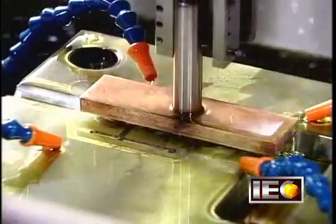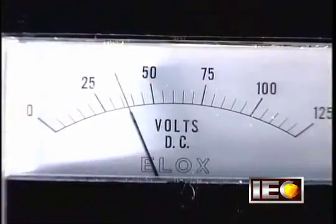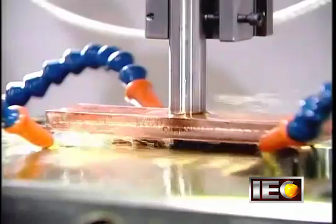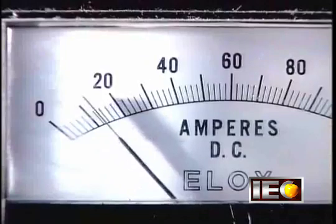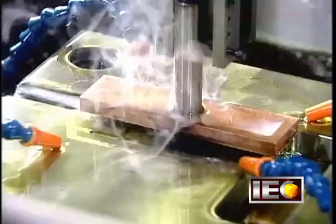The electrode goes face down on the second tooling machine called the EDM. Directly underneath is the mold half that's already been partially formed on the first machine. A strong electric current runs through the electrode and penetrates the mold, forming a cavity in the shape of the electrode.